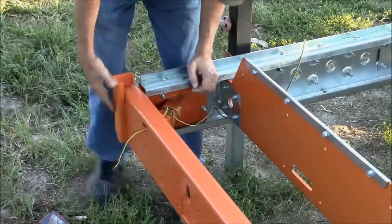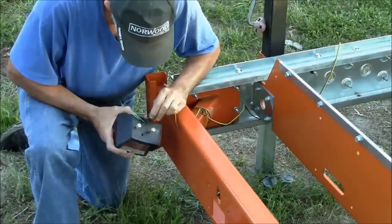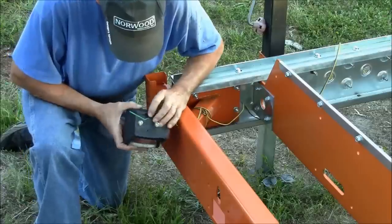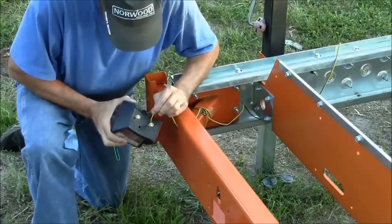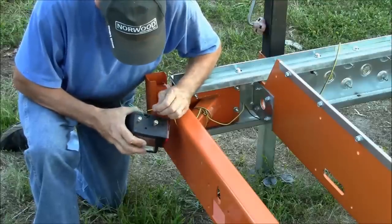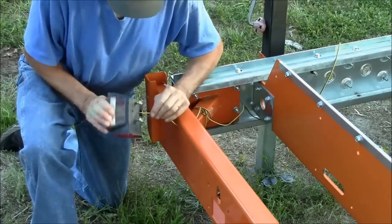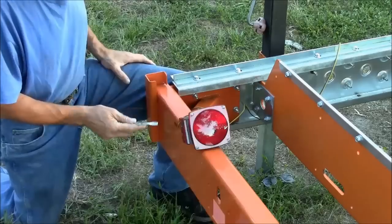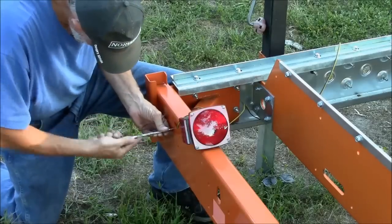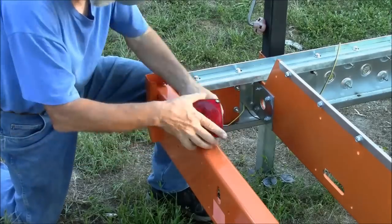It helps to use a paper clip to open up the connector on the taillight when inserting the wire. And you can use the paper clip to make it easier to remove a wire when you've discovered you've inserted it in the wrong hole. Also, scrape off the powder coating from the frame where the bolts go through, and that'll give the lights a good ground.